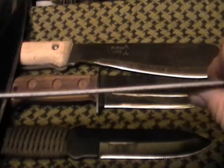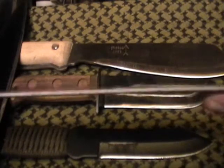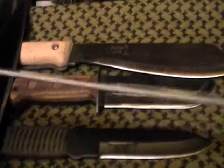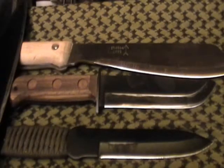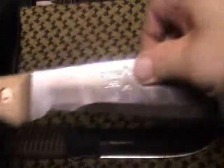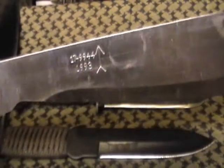but let's go through different blade shapes and a reason why we'll probably end up with a design that we get because of the material we've started off with, which has some spring in it, okay? So we've got to consider it's very thin. So what we're looking at is how much stock we are going to remove from that steel.